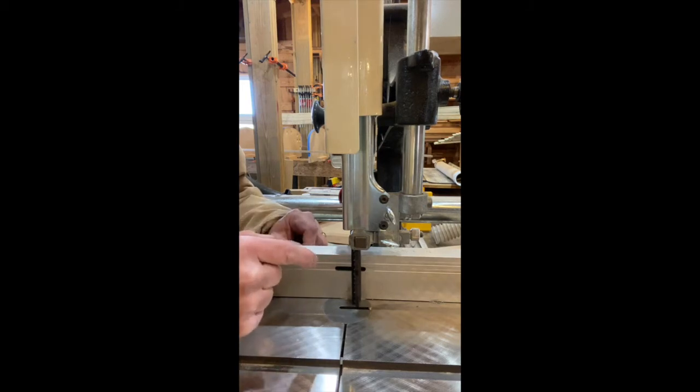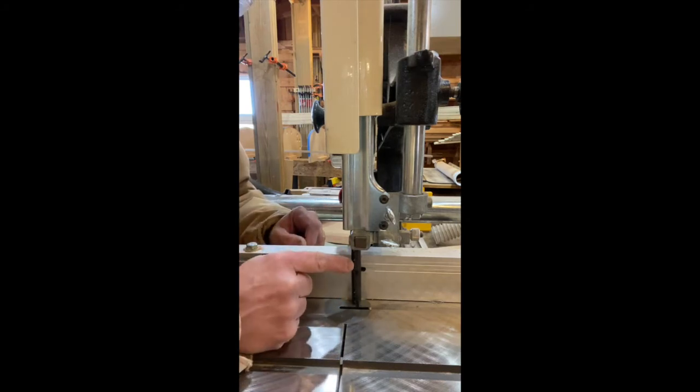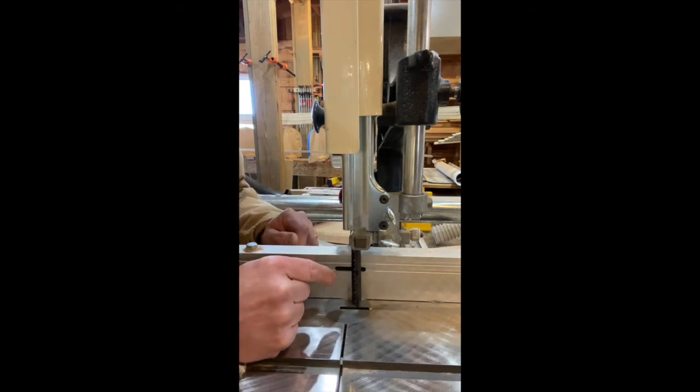This gives me the mobility, especially because I'm running 12-foot boards from one side of the barn to the other. It is a bit of a dusty mess, and this machine is not set up for a larger blade capacity. I also don't have the 93-inch blade used on this standard Delta versus my resaw, which is at 104 inches with the height extension. Sometimes when you're out of blades you can't always use what you want, but this is doing a great job. I bumped the tension up just a little bit higher and it's been tracking pretty straight, so let's go ahead and cut some strips for the canoe.